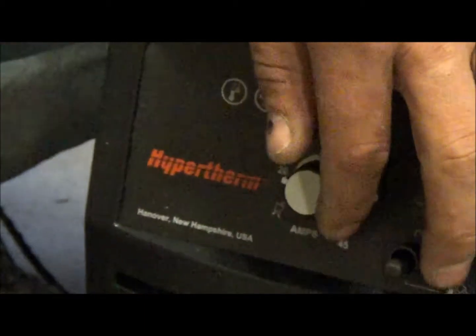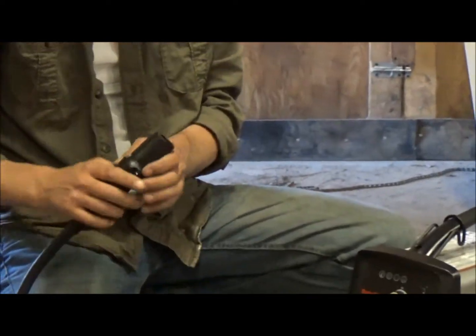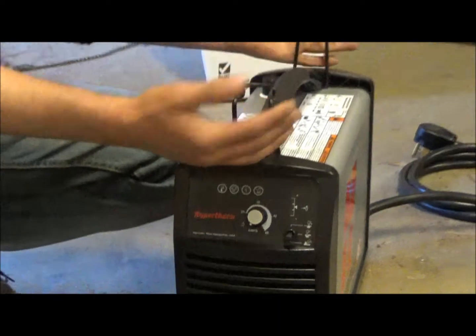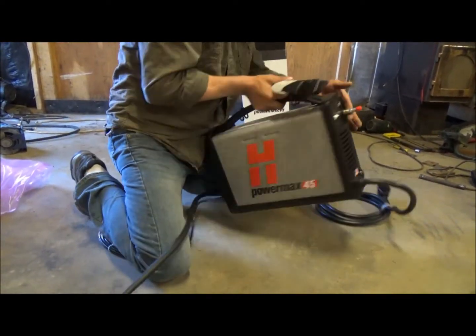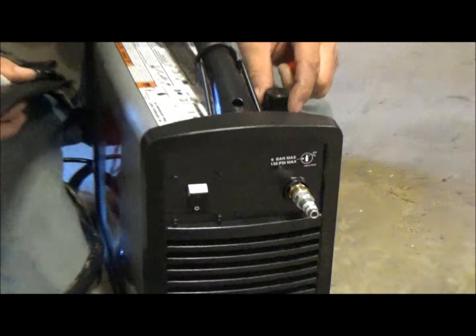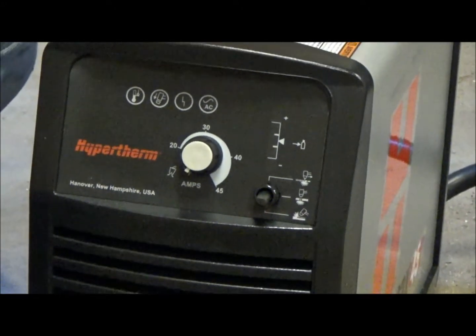It's obviously a 45 amp. So this is the torch — all this does is you push the button in here and you plug it in there, and it's as simple as that. It's got these really nice strap holders here so you can carry it — it's very portable actually. Your air, you just plug in — you don't need any gases or anything, you just plug your air compressor line into there. There's a switch here to adjust, and there's an LED that tells you if you've got not enough air or too much — right in the middle is kind of where you want it. We'll show you a little bit of that when we get it hooked up.